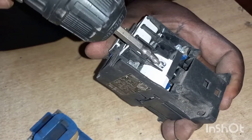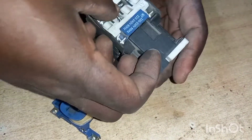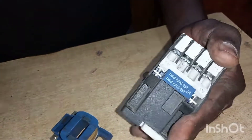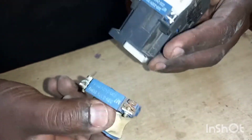Return your screw, then the other one down here. When doing this, you have to check the coil voltage. There is that of 415 and that one of 240. So this one is for 240 — we change with the one of 240. As you can see here, it must be indicated.